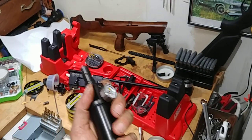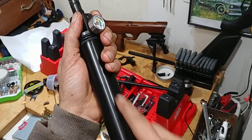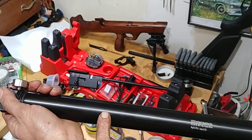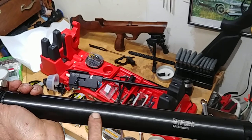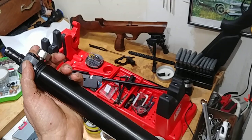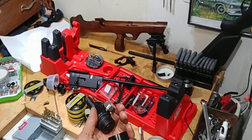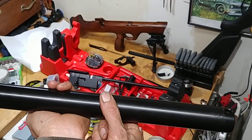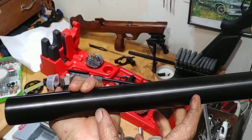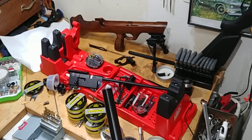And this was a beast to get off, I won't lie. But I managed. And do not put anything sharp like a pair of vice grips or anything on your tube. If you put one hard indentation, that's really affecting the tube safety, and you'll probably have to replace it because you don't want this thing to explode or leak. No one getting hurt. So please do not put vice grips on just leather or anything. That's not enough surface area. Use two blocks of wood, and as I stressed, a piece of leather around it.